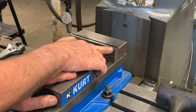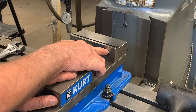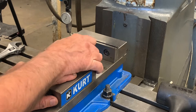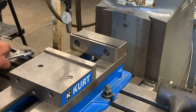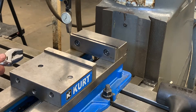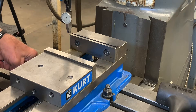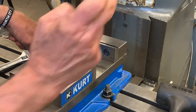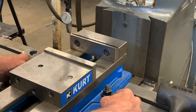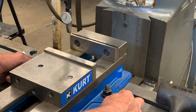We get on the inside of that jaw, about halfway between the top and the top of the counterbore for the bolt — that's where we're going to set our indicator. There are several indicators you can use; I just happened to pick this one. You want to make sure the right side bolt is tight, and the left side, leave it a little loose. Take your fingers right inside and make sure it feels pretty even — that'll get you pretty close.